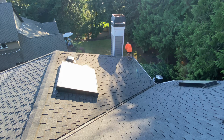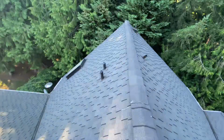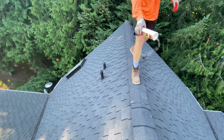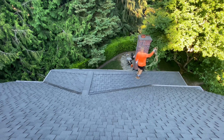So just put it on. Want to make sure we get it over every inch, in and around all sorts of obstacles and ledges and such. Throw it on. It goes on really easily, and really this whole process only takes a few minutes to treat the roof. So get it on all the peaks. The rain is gonna wash it down over the next couple weeks. But generally recommend getting this done every year or so, getting your roof treated so the moss doesn't come back.